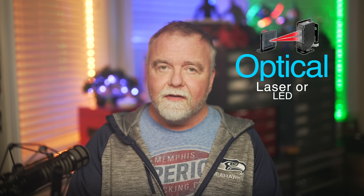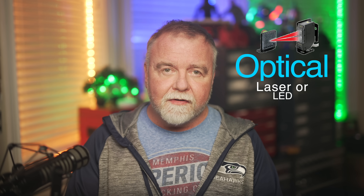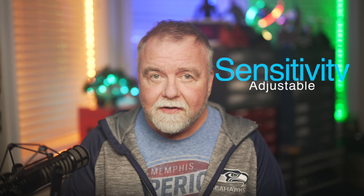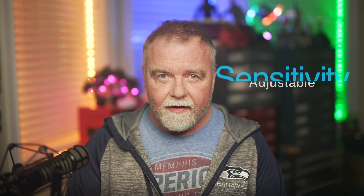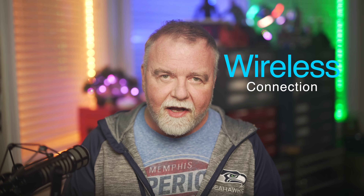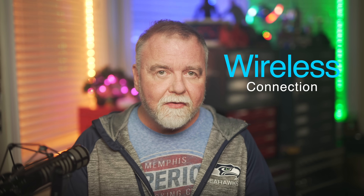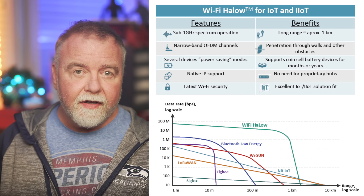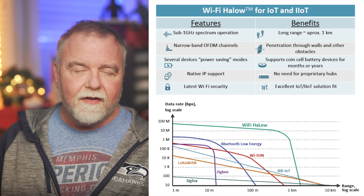I sat down and made my feature wish list. First, I wanted a laser or LED beam system, not an infrared motion sensor. The passive IR sensors are okay for people, animals, and most vehicles, but they struggle to notice things with a low heat signature like a Tesla. I also wanted a sensitivity adjustment so it wouldn't trigger if just a leaf blew by. Next, I needed it to transmit the event to the shop somehow, because I wasn't about to run 200 feet of new cabling. That means RF of some kind, and it turns out 2.4 GHz WiFi is good for a maximum of about 300 feet outdoors. Thus, I decided I would go WiFi. There's also an alternate technology called LoRa that has even longer range, but I was betting I was within the required range.